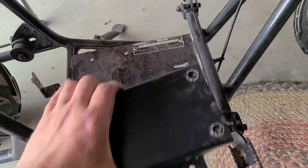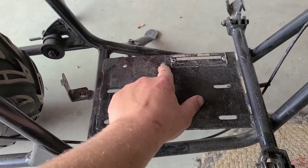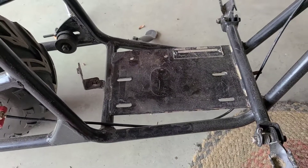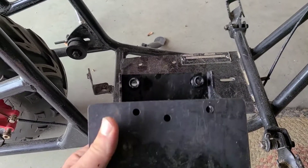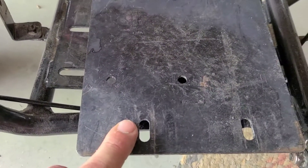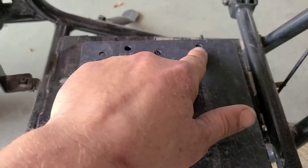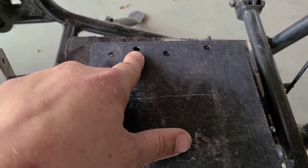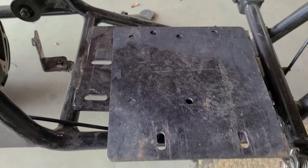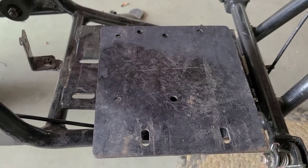So we're gonna have to make our own holes. We should only have to drill four single holes through this plate. And we can still get adjustability where our back ones are slotted. These are our front holes, so we're gonna be extending those to have a slot. That way we can go forward to back when we drill our holes.